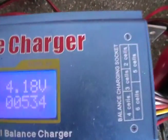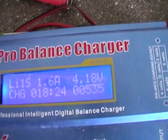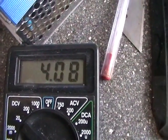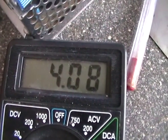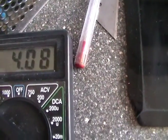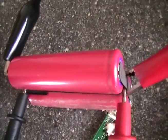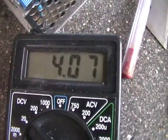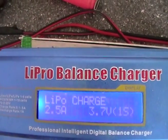They'll still take a lot more — a thousand, fifteen hundred units whatever. So let's see what happens when we stop the charging. It went straight down from 4.18V, so you can see it will lose power. It's basically just a case of testing them or topping up any that are over 3.5V. If you want to get the maximum amount of recycled batteries, 3.5V is the level you should go from.